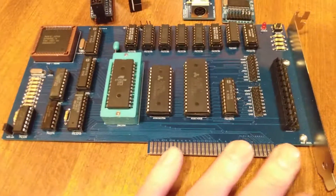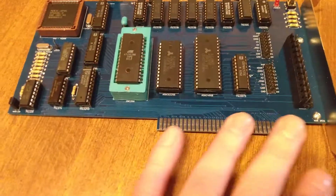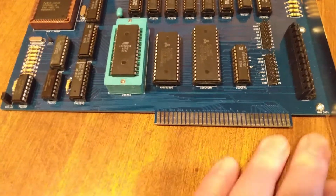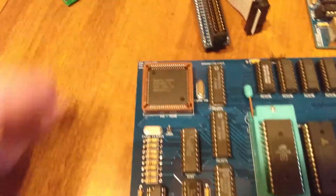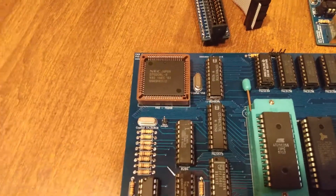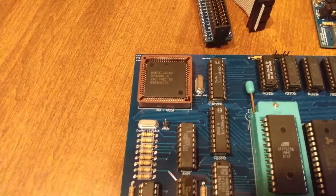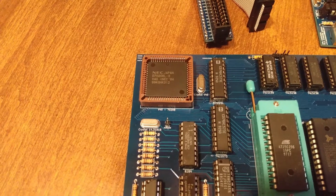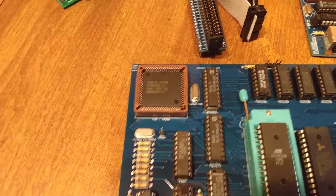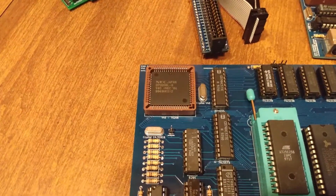And that comes down to our ISA bus. This bus is PC compatible — all the pins are hooked up, including the 12 volts. Over here we've got two crystals. This one is for the processor; it's a 16 megahertz crystal. The processor has an internal clock and divides that in half, so it's running at 8 megahertz. You can see that is the dash-8 V40 there.